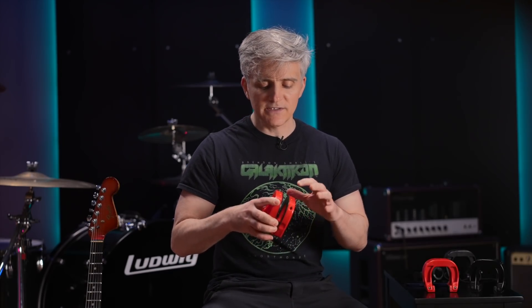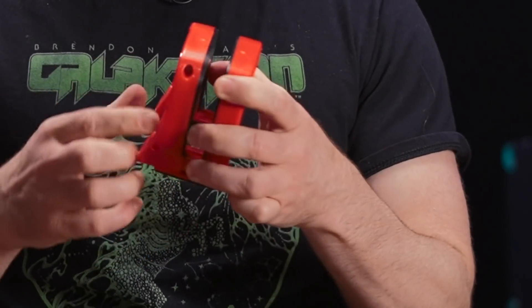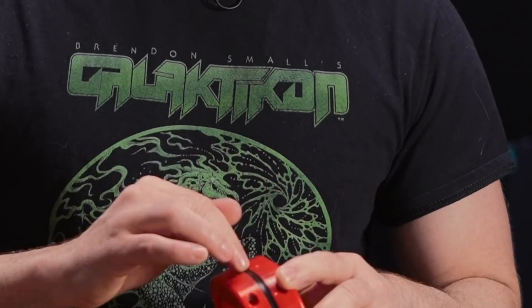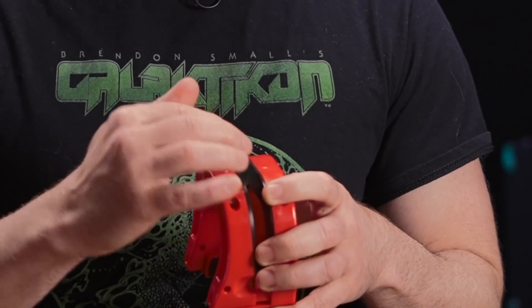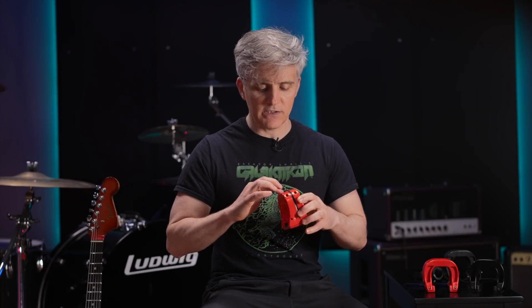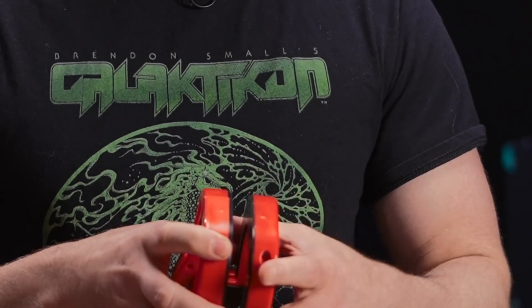Once they got that, for the second half of the year the big problem was the rubber grips. These are not just stick-on rubber pads — this is actually a molded or molten rubber that gets injected into the mold. As it cools, it fuses with the plastic, so you don't need glue. The net effect is that because it's molded, you can make all these really complicated shapes and have them look really smooth and finished. But the problem was the fusing part.